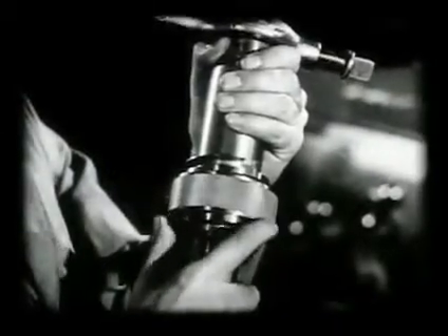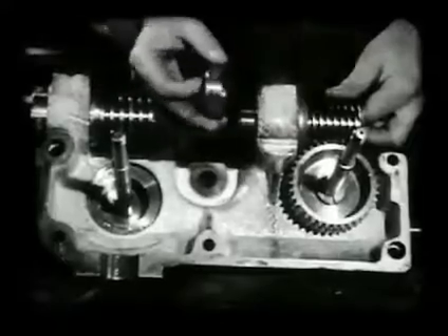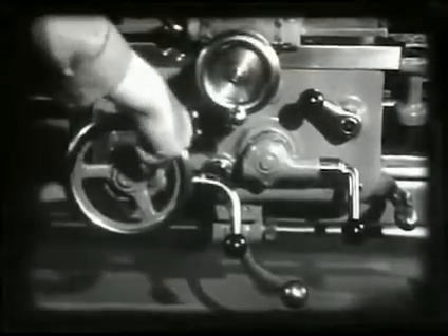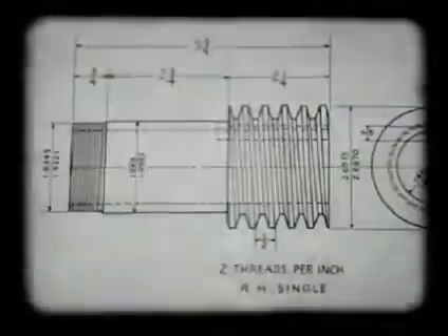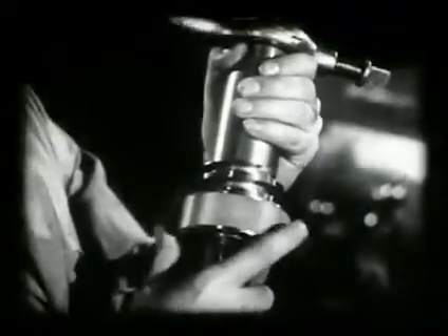The gauge goes on with a smooth, easy fit. The thread is complete and the finished piece will work smoothly in its place in the lathe apron. In the cutting of any thread on a lathe: check carefully the kind of thread and its dimensions; check the shape of the tool with a gauge; always set the tool on center; set the tool to the work with a setting gauge; wedge the tail of the dog to prevent backlash; start each cut with the proper setting of the thread dial indicator; and check your finished work.